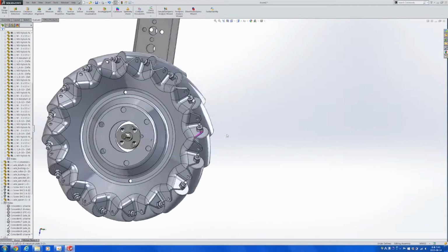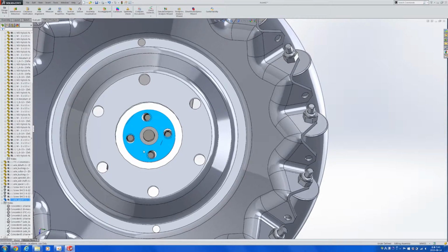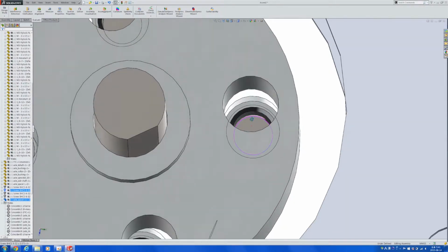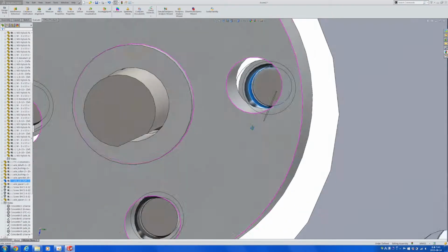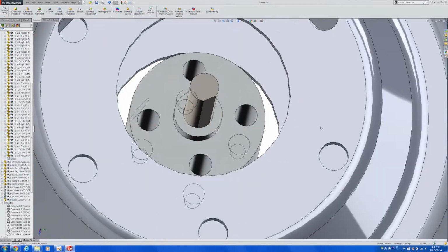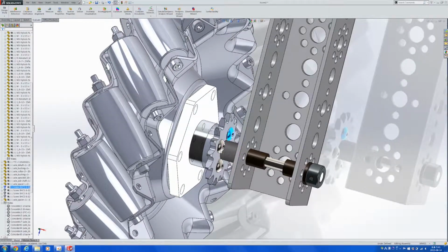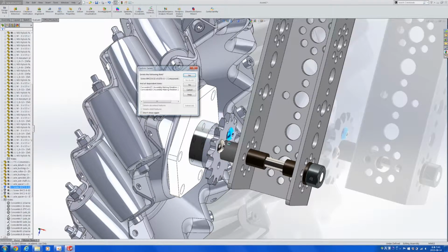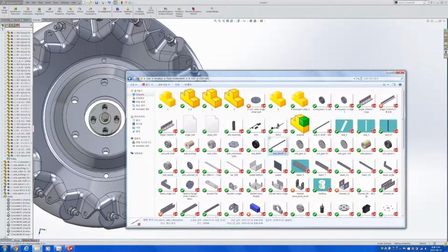But again, something that we may have to wonder is what keeps this axle spacer over here. It's a pair of bolts, but then those bolts go into the axle holder that is on the other side, which means that we can't have 4 bolts on the sprocket side. We have to use only 2 and then leave the other 2 to be used with the spacer.